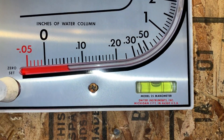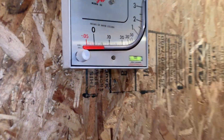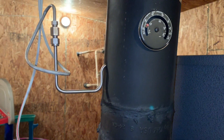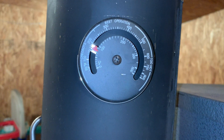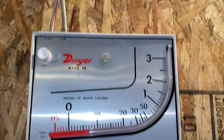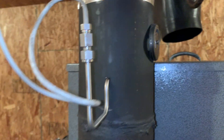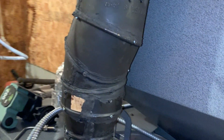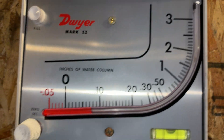The same day I got that all cleaned, I actually got the manometer in the mail, so I plugged it in. We're at 0.06 now and as the temperature comes up it'll reach about 0.08 or 0.09. It doesn't take long for the fire to kick off — it takes off real quick. The ash bed is really good and stack temperature will get about 300°F on the low side. It's just measuring the inside of this room right now, but it'll arrive between 0.07 and 0.09 once it's full up to temperature.